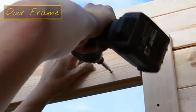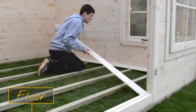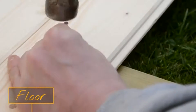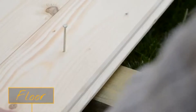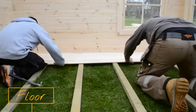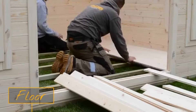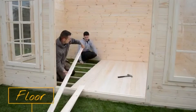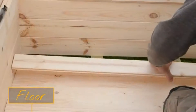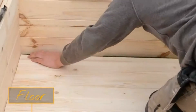The next part to tackle is the floor, but it's pretty straightforward once you get going. Begin at one end of the room and place the boards up against the wall, perpendicular to the bearers beneath. The boards need to be secured with nails into the bearers below. Make sure that the boards are pushed tightly together to prevent any movement. Once you have reached the other end of the room you may be left with a gap smaller than the width of your boards, requiring one to be cut down to size.